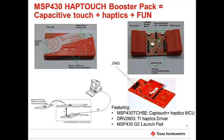It also has ERM motor-based haptics and LRA spring-based haptics actuators. TI's DRV2603 haptics driver drives these actuators. It also has an audio input to demonstrate audio-to-haptics functionality. There are switches to control the actuator types and features. The booster pack plugs into the MSP430 G2 Launchpad, which powers the board and enables PC communication via USB.